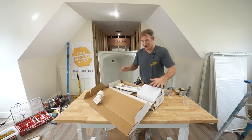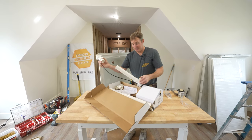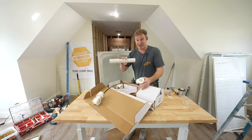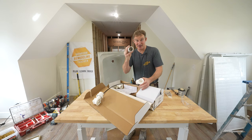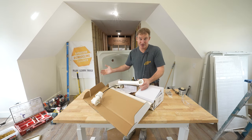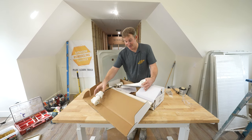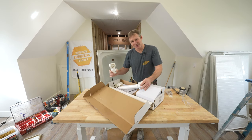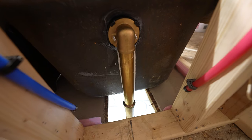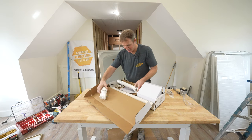You can pretty much grab whatever drain assembly is going to fit on a deep soaking tub. This cable-driven one can fit all different types and sizes. It's all hard-piped, and I do think that having straight 1.5 inch PVC piping is a better way to go — it's all glued, and whether you're snaking it or whatever, it's going to be something longer lasting. The slip fitting types definitely have more flexibility when it comes to connecting to existing plumbing, but overall any plumber is going to recommend hard pipe over any of those other type of drain assemblies.